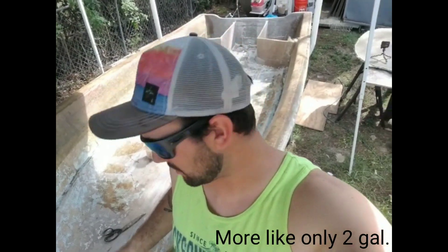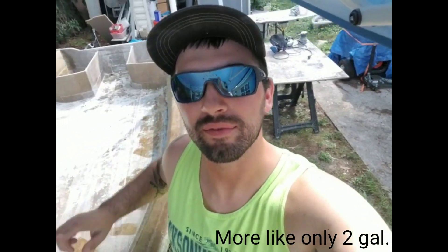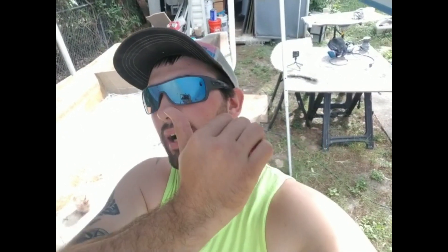This is the day after I did a bunch of grinding and sanding, and I laid up two and a half gallons worth of resin on the little skiff. I built that bulkhead that you see right there behind me, and I'm going to cut, grind, and clean that up, wipe it down with acetone, sand it all, get it all ready to get bonded down into the little skiff.